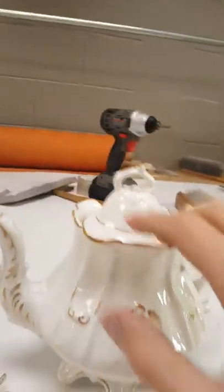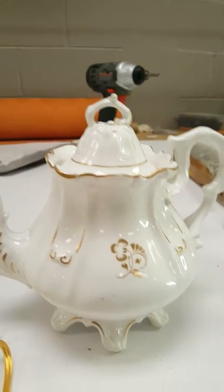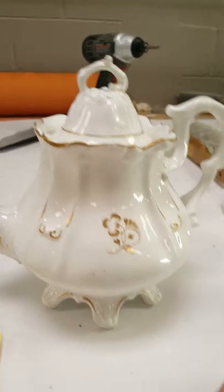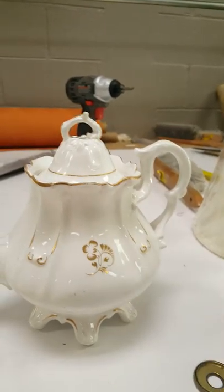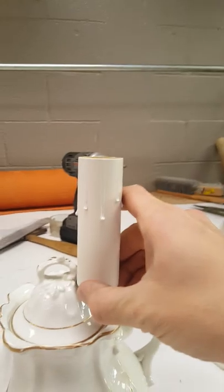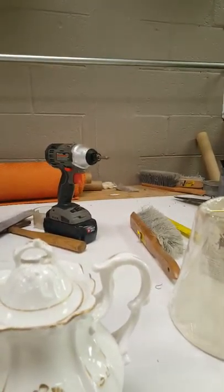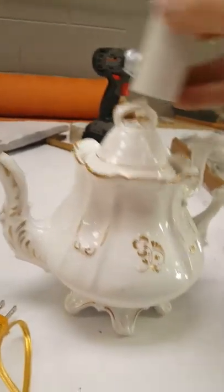What I'm going to do is chop the spout completely off, then do a check ring — a series of those will go in here. Then my riser, which will be a candle drip. Inside that will be the socket, and then the bulb. This is a bulb-clip lampshade, so it will clip right on the bulb, and I'll wire it to go completely out.